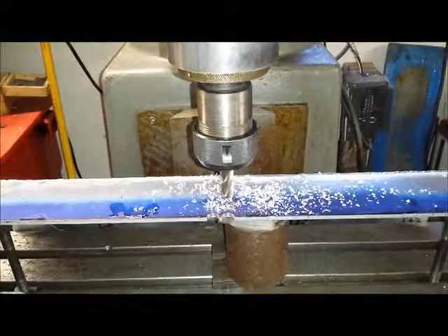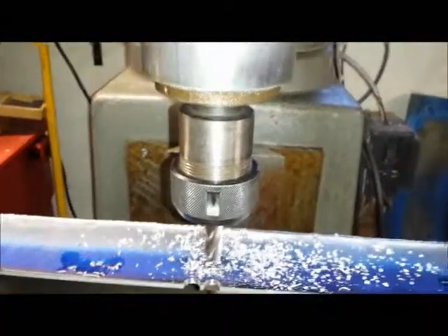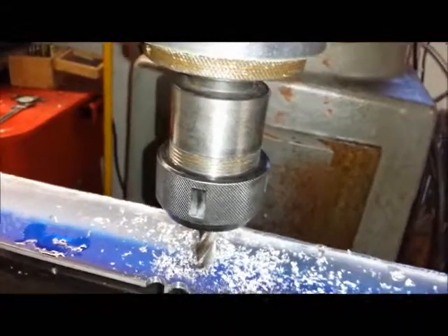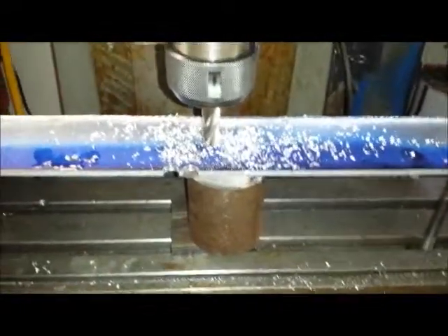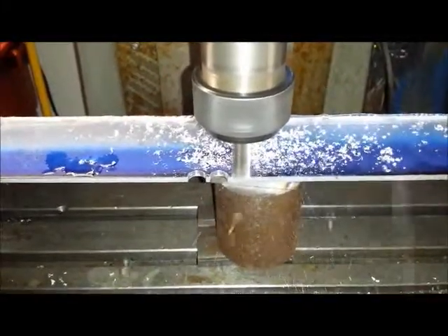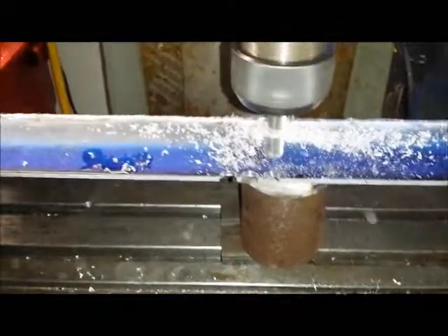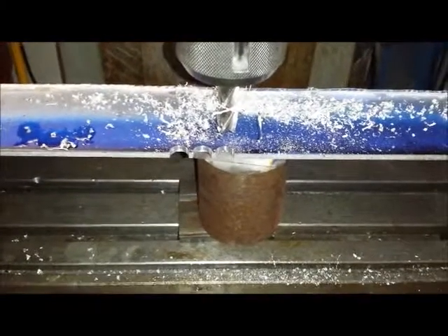I'm using a half-inch end mill with a half-inch offset, and I'm making every hole exactly 600 thou from the other side of each one — so we'll move it 600 thou, lock it down, start up the milling machine, and here we go. There's our teeth. This one is actually on the center mark. I'm not going to keep you around while I do all these holes — we'll come back.